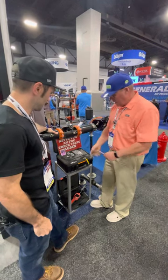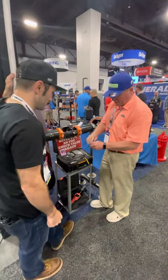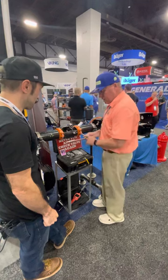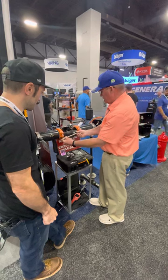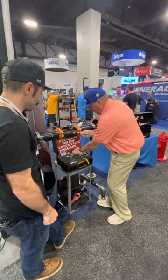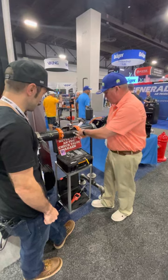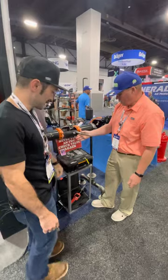Remove the plug, and we have these rods that are special-made for each check valve. They've got a number on the end — the number indicates what check valve you'll be using. It's simple: just keep the flat side of the rod up. Once you have the plug removed, slide it in and grab a half-inch threaded nipple.